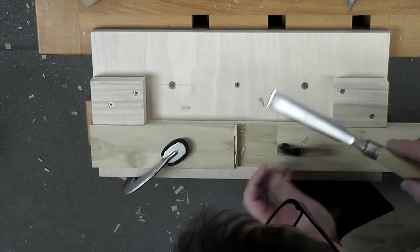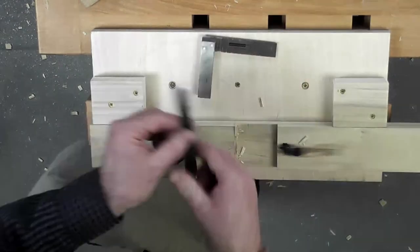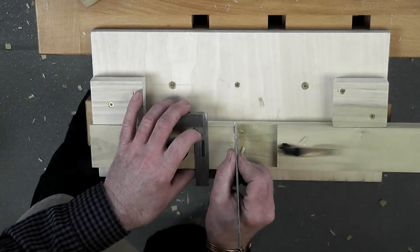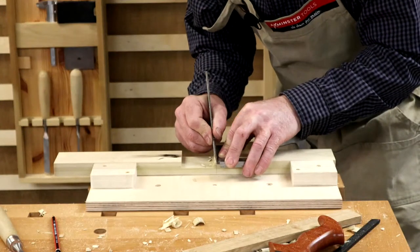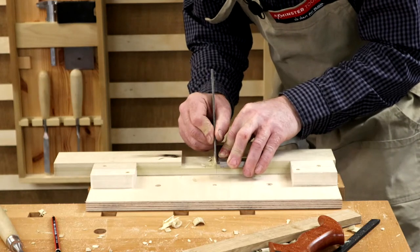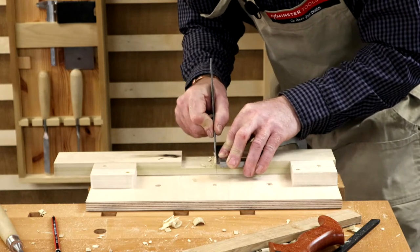Carefully just dropping the chisel into that edge to create that V. I want to clean it back out. So knife again, I can slide up, rest it on the back of that face now that I've already cut. Position it, lock in with the left hand. Keep the knife nice and square to my body. Pull it across, clean out the bottom.